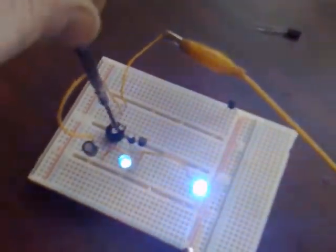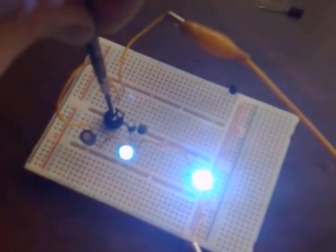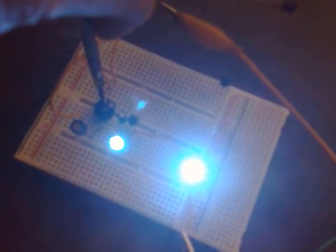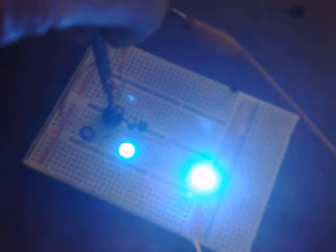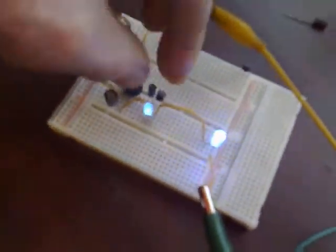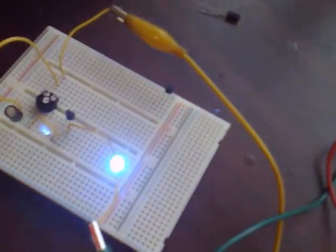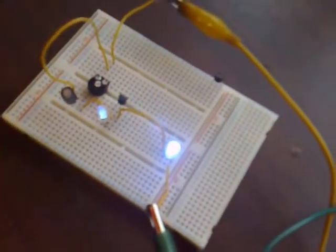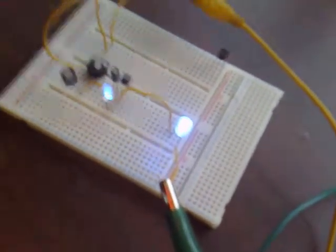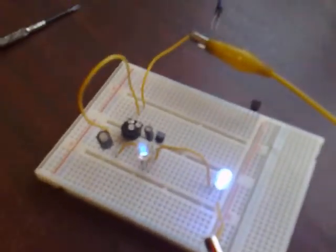You can hear it on the loudspeaker. I'll just turn the pot so you can hear the frequency change. So that's going into the loudspeaker. This capacitor here — the timing cap — I'm using a 0.47 microfarad at the moment. Actually, that one is a 10 microfarad; this one here is the 0.47. That basically changes the frequencies — it's like the frequency range cap.